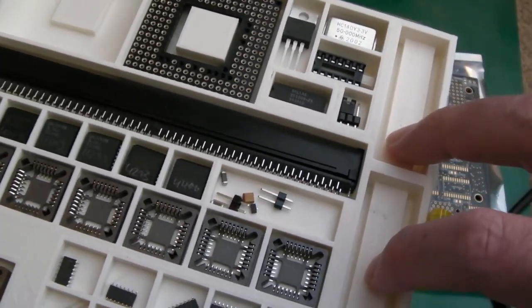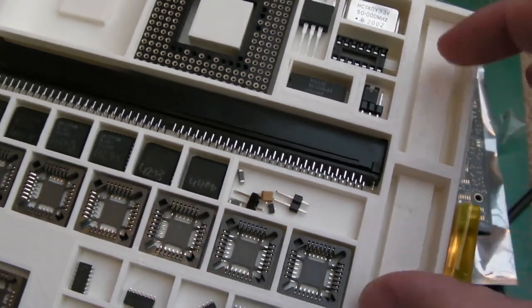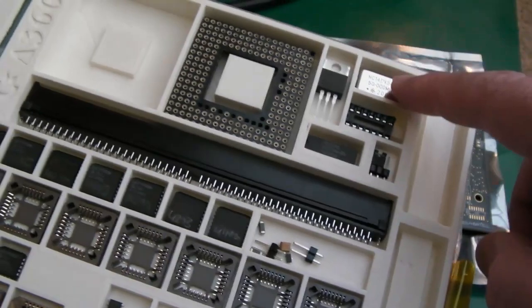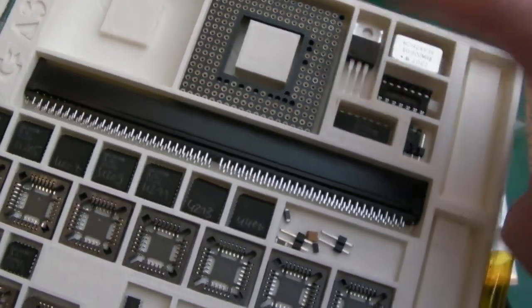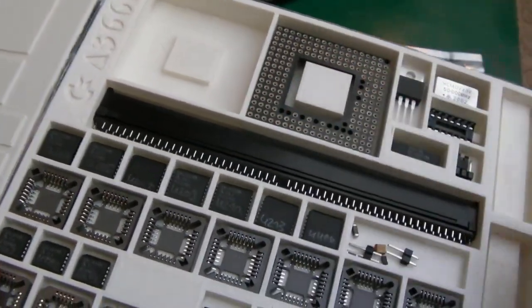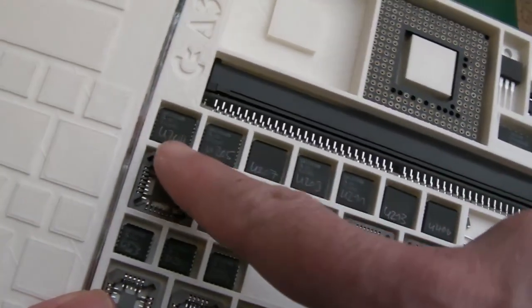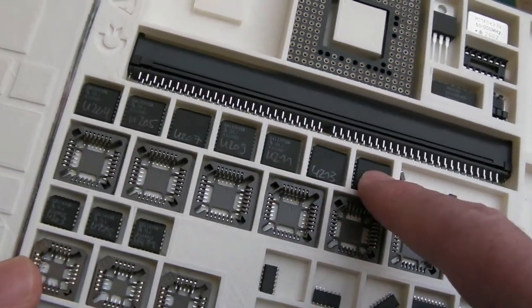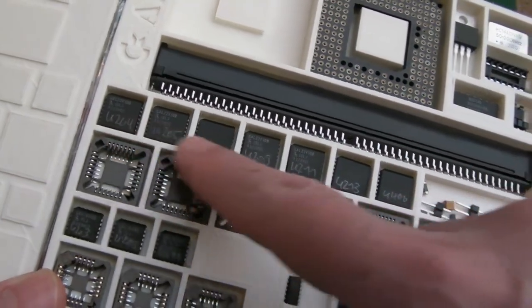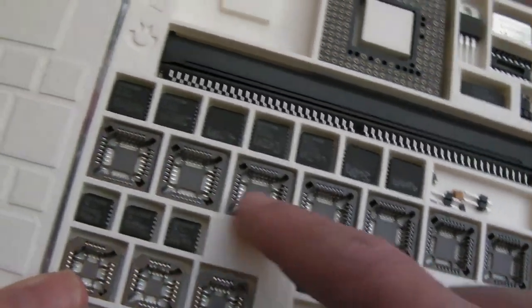Some instructions as well, and yeah, everything is in here. You can see there were two ROMs — I've got those in my motherboard at the moment. You'll have seen that when I tested that A3640, because I had the Kickstart 3.9 in there. So we've got everything here: crystal, voltage regulator, socket, delay line, jumper, 68060 socket, another connector, all of the GALs all pre-programmed.